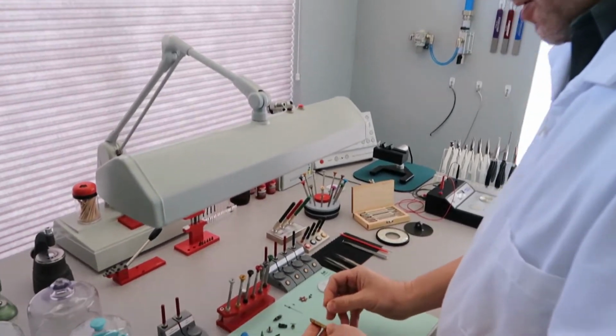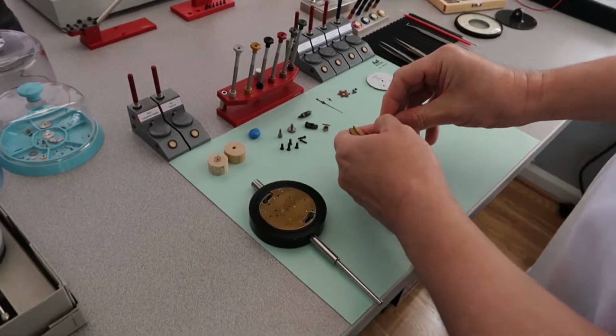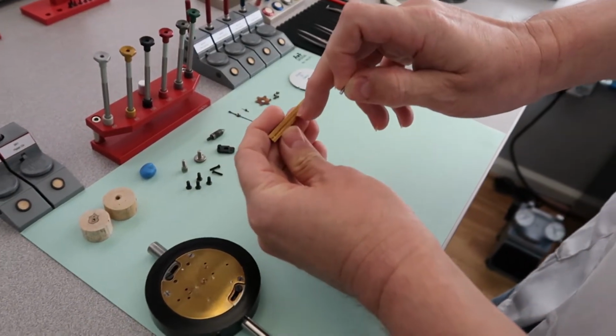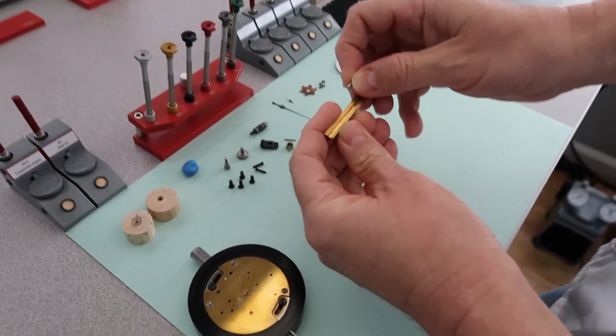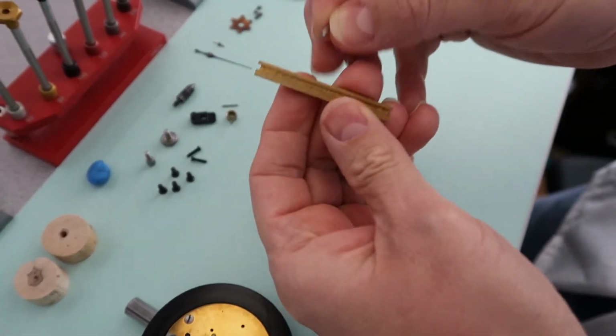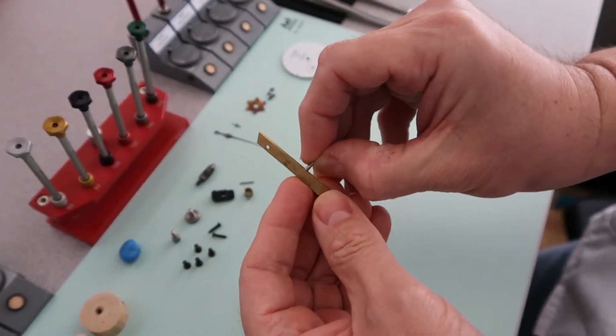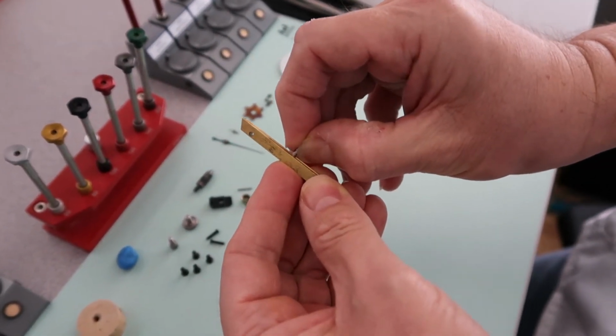Because right away, working with watches, when we service watches, you don't want to start modifying components just because they won't fit. You only want to make adjustments. You want to leave everything original. So in our case, what I did was I first polished the pin, and then I polished the slot. You can see it's really shiny. Under the loupe, these two parts are perfect. But for some reason that we can't understand, it just won't ride in the slot.